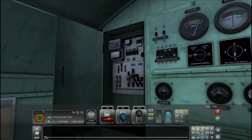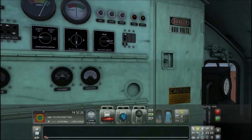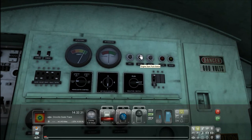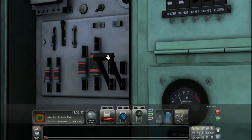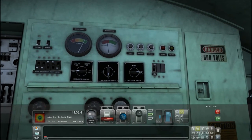That's in Fahrenheit. Assuming I didn't forget anything we should be good to crank. To crank, find the engine start switch and hold it. And of course I missed something — oh yeah, most important thing: the battery knife switch. Make sure the main knife switch is set on. Now everything's set — crank.